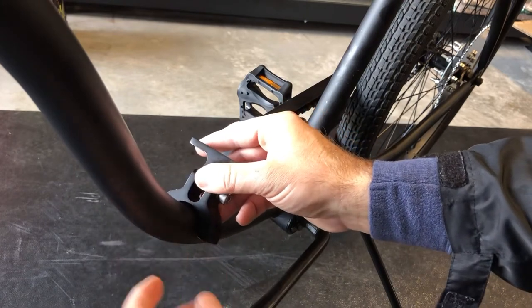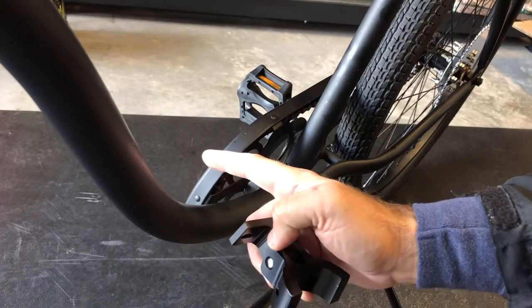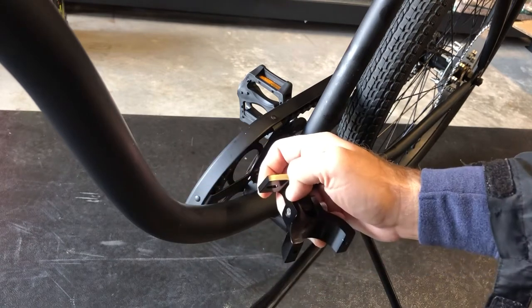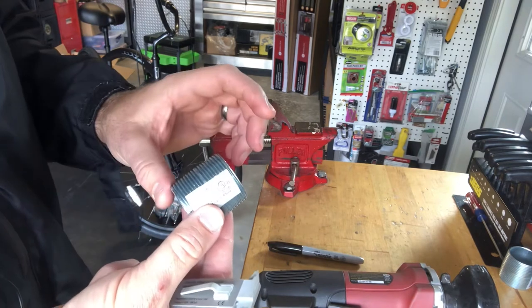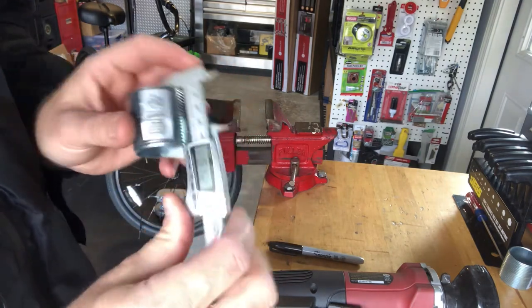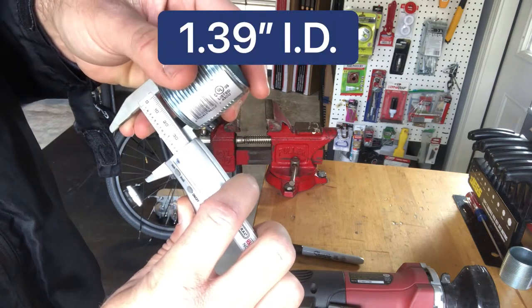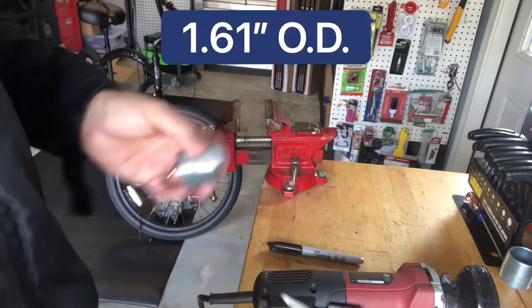What we're going to do is go to Home Depot and pick up a steel conduit nipple which is 1.25-inch diameter. With one conduit, we can splice it into three sections and use it for three future builds. I just got back from Home Depot — this one is a bit shorter than I typically get, so we'll get two cuts. The measurements are about 1.6 inches in length, ID 1.39 inches, and OD 1.61 inches — that's going to fit perfectly.